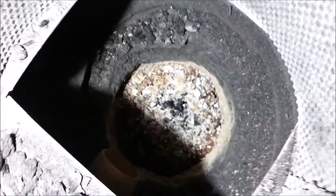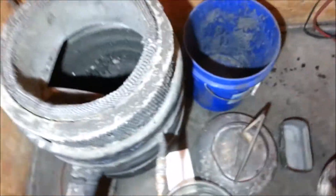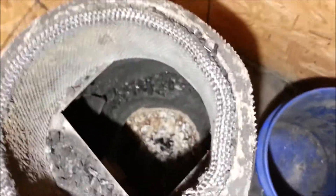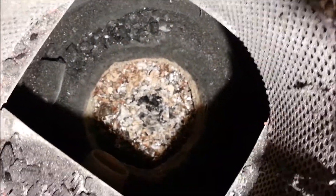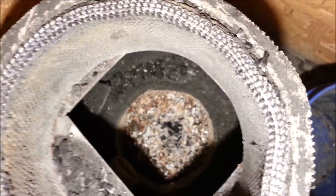What we're looking at here is an ash pit. I burn about 30 gallons worth of charcoal in this device. I'm going to take the ashes out and measure their volume — I don't have anything to weigh them, but we're going to look at a volume percentage to see how much ash you can expect in a charcoal gasification system before it becomes a problem. 30 gallons of charcoal is quite a bit — that's like a trash can full.